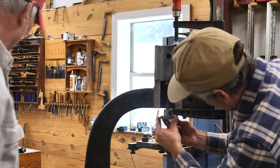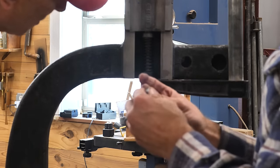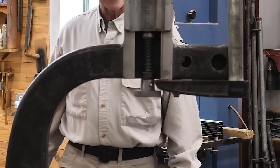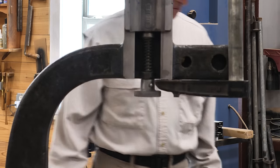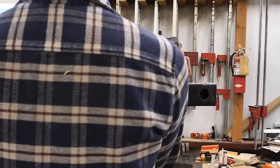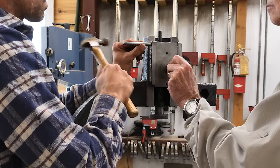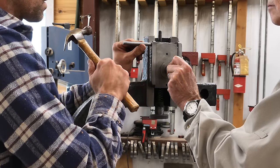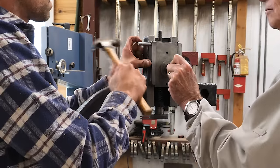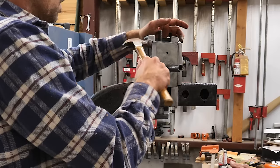We got it — and we don't want to find out what happens if it shot through the roof. That's the tapered pin. I learned my lesson on my old saw that these are actually tapered, so you don't want to go hammering on the wrong side because you can ruin them real quick. You've got to figure out where the small diameter is and start from that end. I'm moving the camera to get the perfect shot of me tapping this pin in, but then I forgot to hit record. So you missed it, but you get the idea — I tapped that pin in and locked that knob in place. Now we're putting in basically a hinge pin that allows this piece my dad's holding to hinge and move. That piece has a shaft on it that holds that top wheel of the bandsaw. Once you get it lined up, it knocks into place, no problem.